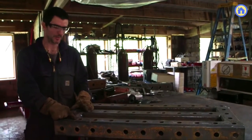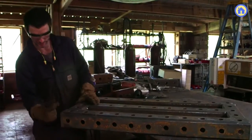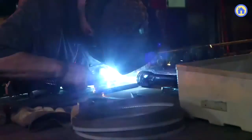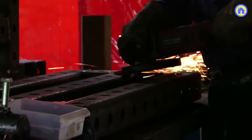This is the frame of the microtractor. We started with the whole tubing, our modular construction tubing. We cut it with an abrasive cutoff saw, then we welded these pieces together, and then ground them finally with a grinder to make this base.